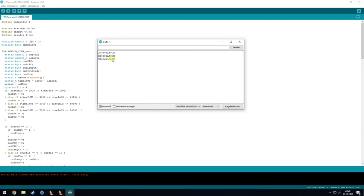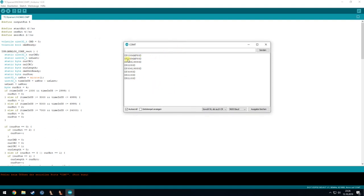Then we'll also press a program button, and you heard the telephone, and also it was just sent one time. The telephone answered to the outside station, and this command is just to notify that the calling is ended and I can answer the telephone. So if I pick up the telephone now, we get a command which states the beginning of a call. And if I put the telephone down again, we get some end call protocol and that it's done. That's quite simple. You can parse, as I said, these values on your own inside of the Arduino if you want to build something like this.